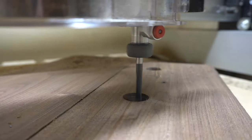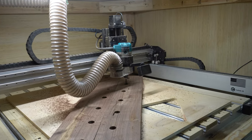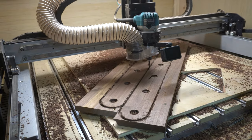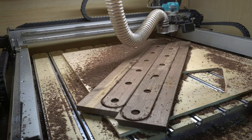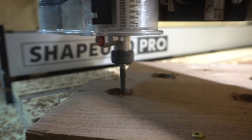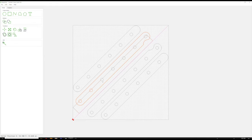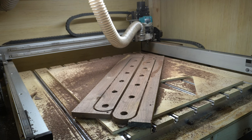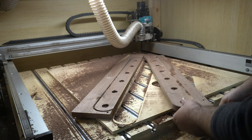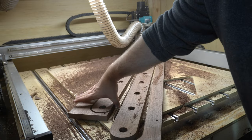This left a slightly less desirable result at the top edge, but was easily sanded off afterwards. After cutting all the legs out for the first pickler, I was really happy with how they looked — until I realized that the two legs with the inset on them can't be the same. The holes need to be on the inside of the leg for the pegs, and the inset portion needs to be at the top, so they actually have to mirror each other. Not all is lost — I just needed to make one more of the long legs with the correct orientation.